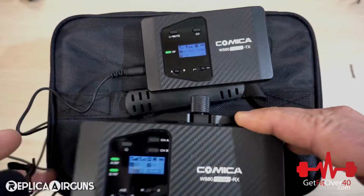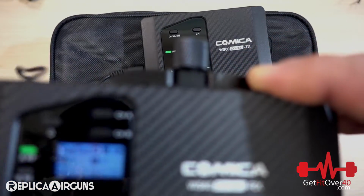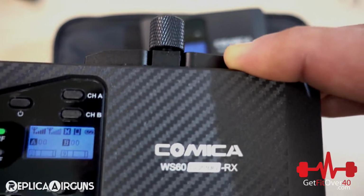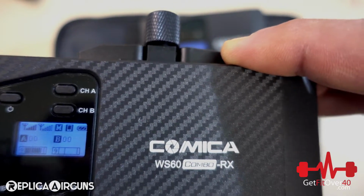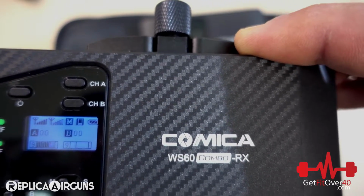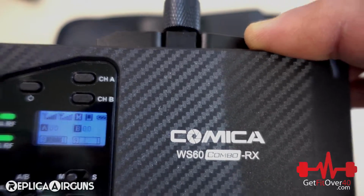Pretty cool. So if I bring the channel A input down, notice how we're not getting any signal. I'm talking, right? I'm going to bring it up a bit. See how I'm getting a little more level, but as I jack it all the way up, it gets a little too loud perhaps, right? So once I'm monitoring that, or my camera guy's monitoring it, he can adjust it on his end, make sure there's no distortion or that one person isn't too loud over the other.